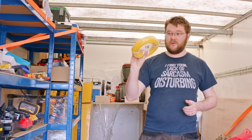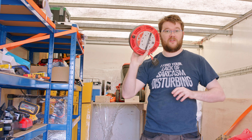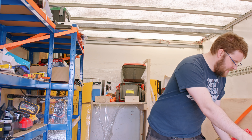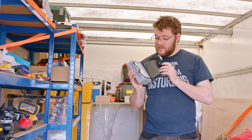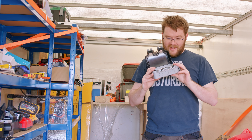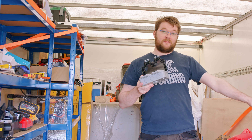To do that we've got some flexible cable, and this one in particular we're going to pull apart. It's a good length of cable, but this alone trips the earth fault detection — it was in the mill when we got here, so it's of unknown origin and quality. But the cable itself should be fine, so we're going to attach that to a couple of outdoor units. These are what we've used on the IBC for power — they give us a little outdoor box. You can get these with earth fault protection, GFCIs, or RCDs depending on what country you're in. This will allow us to have our power plugged in and protect it from splashes and even general soakings.